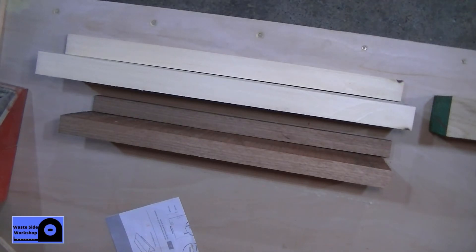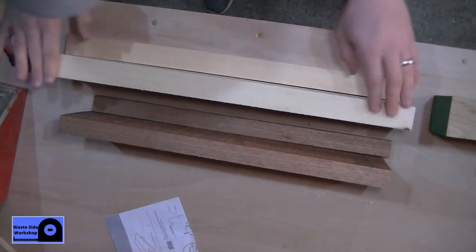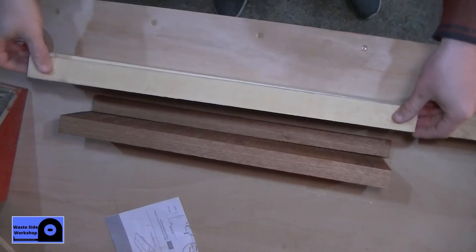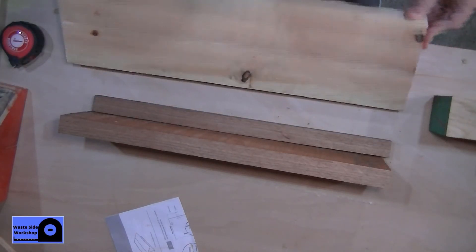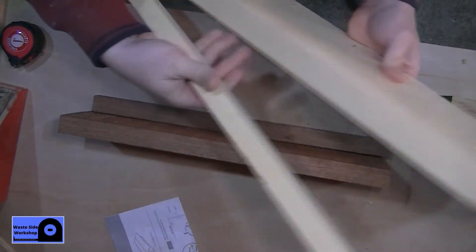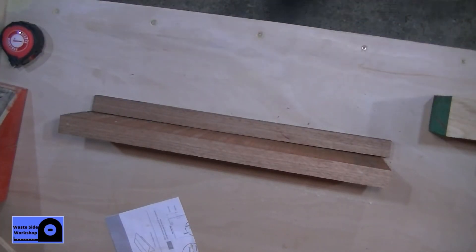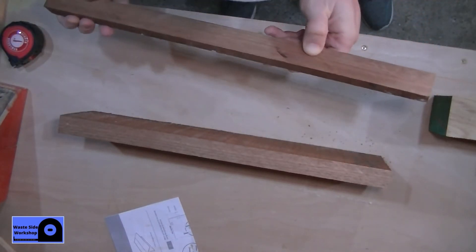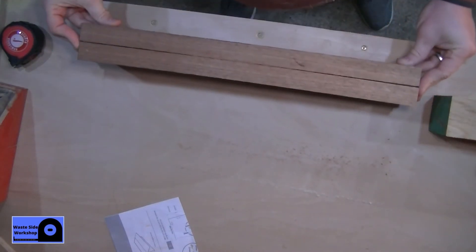That was me measuring 36-37mm — some saw marks on there with a nice clean square cut. Had a bit of a judder along the way but nothing I felt unsafe with. All in all a pretty good cut with no chipping or breakout. Cut three was the sapele — I left quite a few teeth marks in it and there's a bit of a burn there, but I think that's from where I paused to grab the push stick. It went through without too much of an issue.